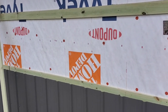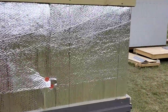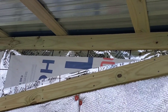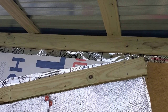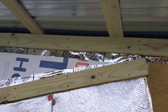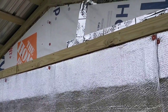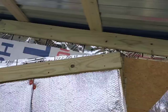That's the exterior update. For the roof, I did do a unique design — in between the metal and the top I put down rain ice guard, and I have a big space between the actual wooden roof and the metal. That's so we have really good air circulation under the metal roof. We don't want this to bake in the summer.